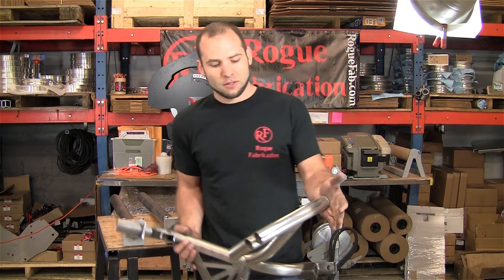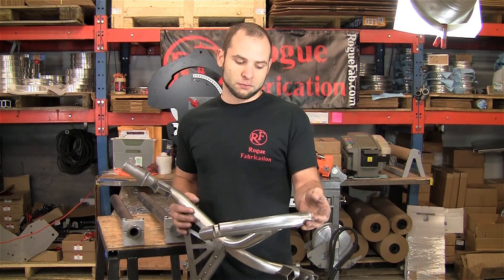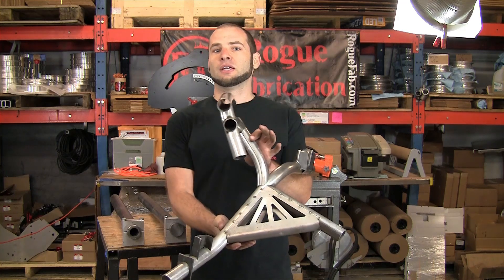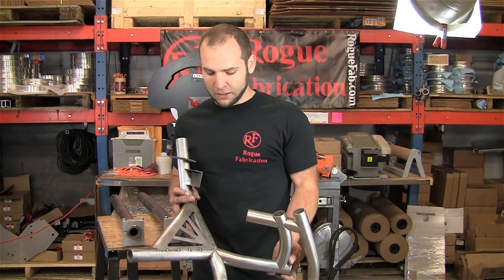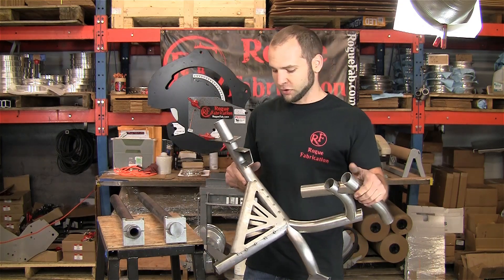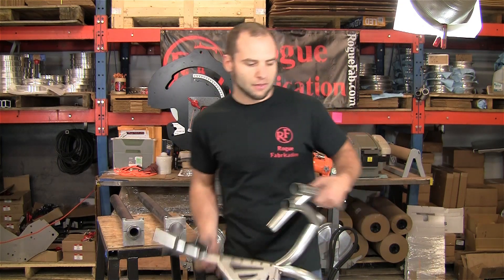This is the same bender, Model 600, that can fit our thin wall attachment, which we're going to explain in a different video, and it bends thin stuff — so this is 060 stainless. It does a pretty good job considering the thin wall on it, and this is just an example piece that we notched a whole bunch of holes in to show the different stuff our notcher can grip on, but that's a different topic.